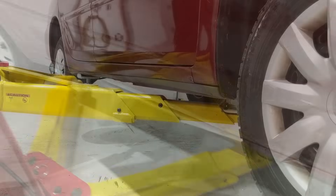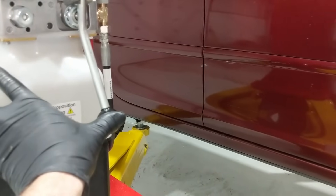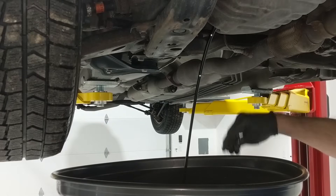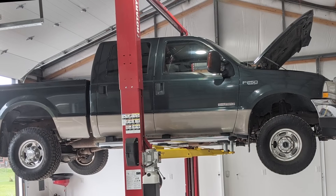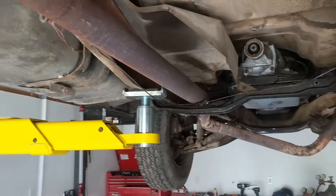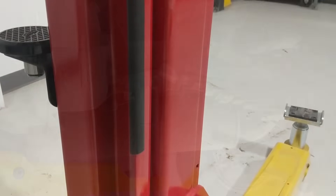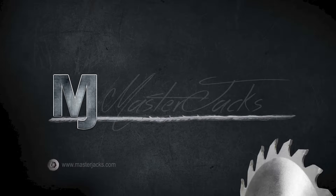The first vehicle I lifted was a sedan — the arms were nice and low profile and went under without any problem. Setting the vehicle on the locks, they engaged simultaneously and worked as they should. We raised it up off the locks and the lock mechanism released as it should. Next was a Super Duty F-250 diesel pickup — no arm deflection noticed, very sturdy. Then a Sierra 1500 dump truck that was pretty heavy, using a combination of truck adapters to engage the lift points — very sturdy with no nervousness at all. We also installed the door protectors and brackets for holding the car and truck adapters. I hope you found this useful if you're shopping — please like and subscribe.